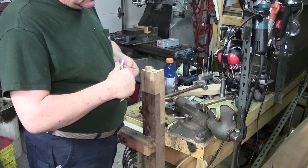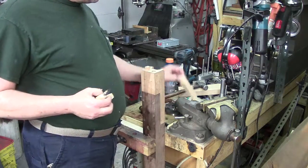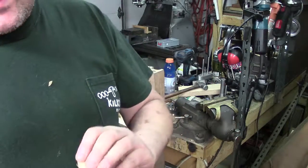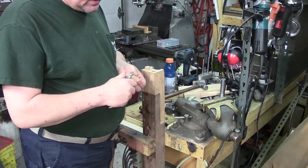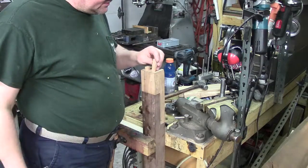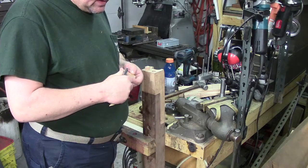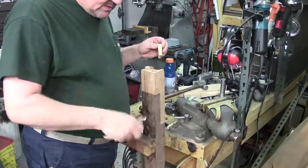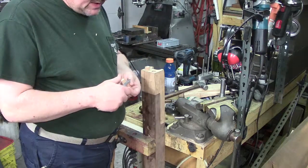So we're getting pretty close there, because I'm going to use similar woods, and I made sure that when I cut this, it was from the end grain, because it's going in end grain. So you can see end grain, didn't matter, just took a chisel, tore a piece off, nothing fancy. This is why you always keep scrap pieces of your working woods around on your projects for stuff like this. And you just go through and you fit it all the way around. You don't want to jam it in there too tight and split it, just like we talked about pre-drilling on the other video when we pre-drilled all of this stuff. You want to be able to get it fit relatively close.